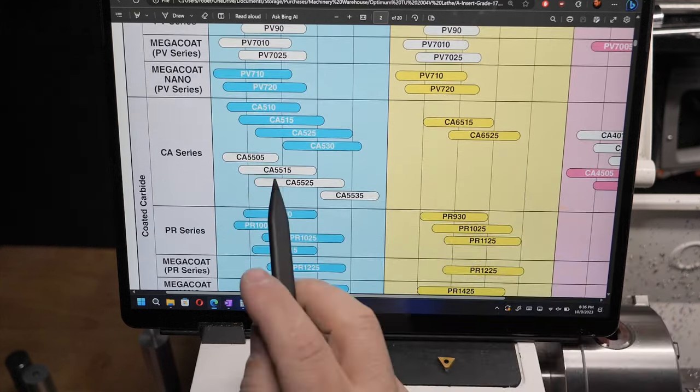I think those both look good. And I was pleased to see that the 0.8 was slightly better. Certainly when I see it in my hands here, that's slightly better. So the finishing one, the TN60 insert, the PVD, what do you call it, cermet, gives me that finish. And it's exactly the same as the steel. It's a tidier cut, hasn't got any of those smooth spots that this has, and overall very nice. But in the middle, the steel, that is visibly better.